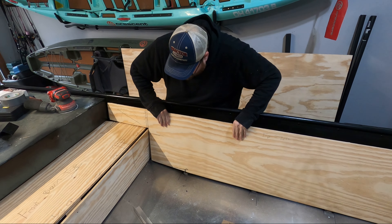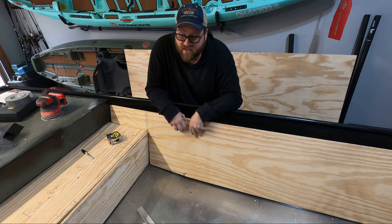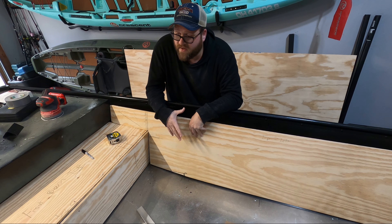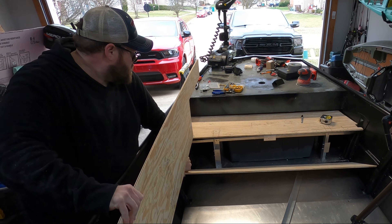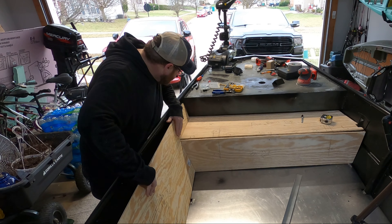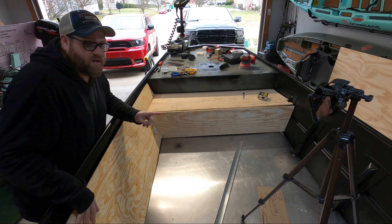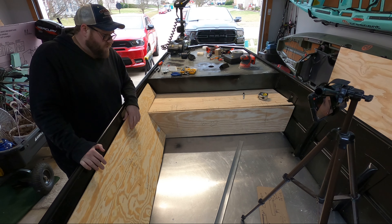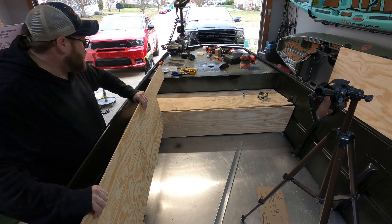To get this angle set for the front bench I had to account for a couple different angles. The first angle was the flatness of the floor up into the rise of the floor. I accomplished that by taking the top of the rise which was three quarters — I measured up and then I drew an angle down to where the rise starts, which was actually right at the brace, so it was pretty easy to do — that was just one cut. Right towards the top of the front bench on the floor there's a little bit more of a steeper rise, so I just used the orbital sander to sand up a little bit of the rise right there, and then everything else just seems to be fitting, so go ahead and test fit it one last time before we move on.